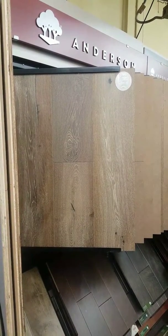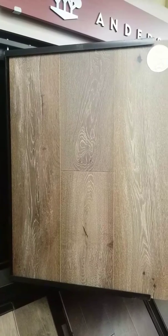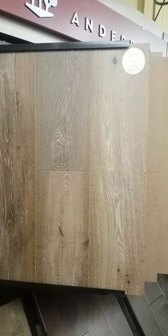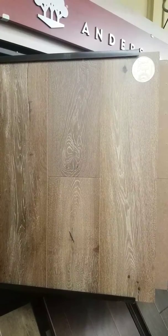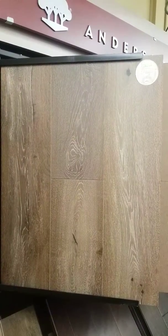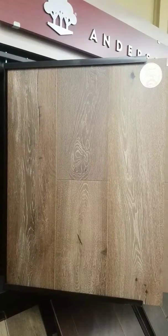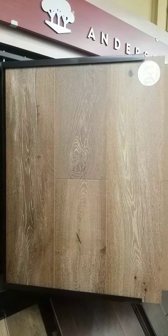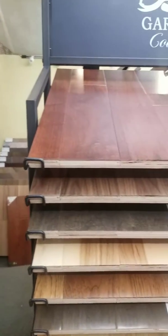One product we're looking at right now is Grand Pacific. It is a wire-brushed urethane aluminum oxide finish, which gives that oak a different appearance than it had in the 80s and 90s. I always tell people oak has come back with a vengeance — it's a wider plank, a different look, and it's still really hardy. Oak, hickory, and maple are all on a Janka scale, where a steel ball is driven into the wood at a certain velocity to measure hardness — not scratch resistance, but the actual hardness of the product. Oak, maple, and hickory are right in the middle of that scale and are typically used as a standard.